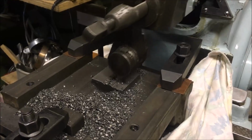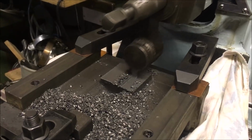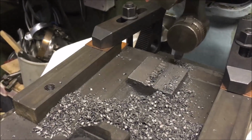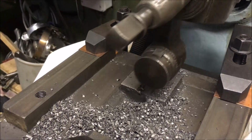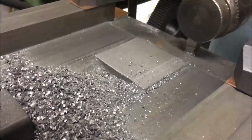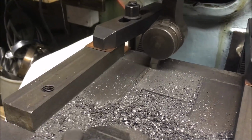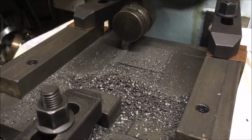That's third gear, 80 thou depth of cut, 5 thou step over. Unfortunately, the phone ran out of charge, so I've eased off since I was speeding it up and got the depth of cut to 100 thou. Motoring through it now. That's the last pass, which takes it 10 thou below the guide surfaces. Or was it? I'll just inch it back.